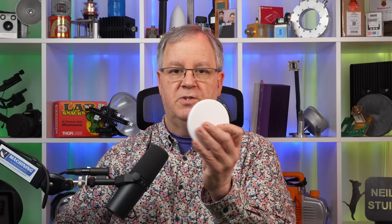Machining a microwave lens from a solid block is very wasteful of material. Injection moulding is feasible for some types of lens material but making suitable moulds is ludicrously expensive. It's certainly possible to use a 3D printer to make a solid lens, but here's where we can step up to a whole new level of possibilities. 3D print technology lets you make much more complex lensing structures that can manipulate radio waves in ways that solid lenses simply can't.